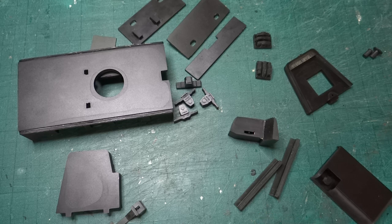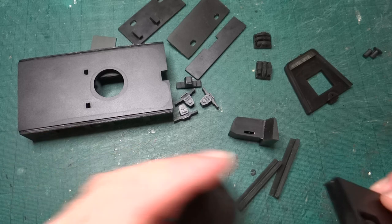Once you've got the doors assembled, obviously you can put the handles on and things to make them easier to take on and off. You may find that you need to file the bottom of the doors to get them to fit nicely. Again, the sizing I've got is for the exact size, but there are slight issues and tolerances.